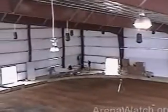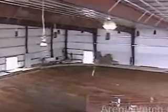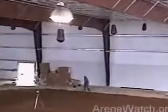Another important factor of the lighting, which you'll notice with all the fixtures, is they're all installed at the same elevation. We also are careful to be sure that they don't conflict with the beams themselves. And they're slightly below the beam height on the low side. And then from that elevation, everything's run true across.